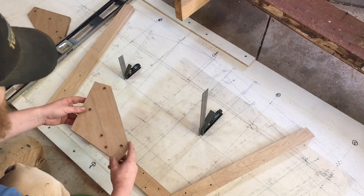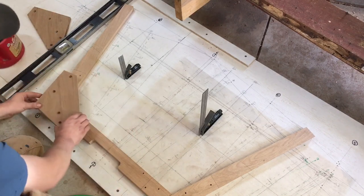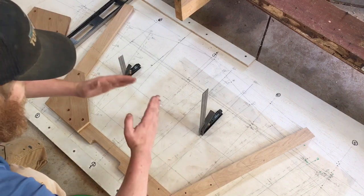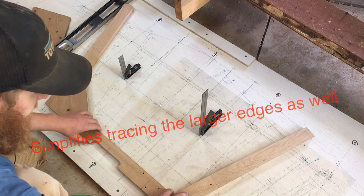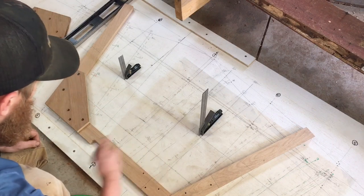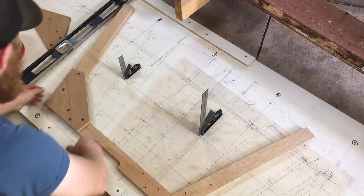These are half-inch marine-grade plywood. This whole boat is built with plywood — the bottom plank is going to be plywood, the bottom will be plywood — so all of this is going to be sealed in epoxy. I laid them on there with the wider side of the frames down on the plywood. That way you think of how the boat comes together at the bow: it's going to be pulling against this and pushing on the other side. I'm only going to be using one gusset. Some builders like to have a gusset on both sides and put a little filler block inside. I'll try and leave a link in the description to a video by Mark Rutten where he goes into more depth than what I'm doing here.